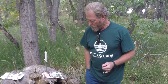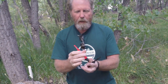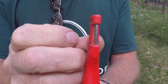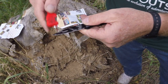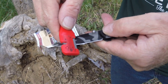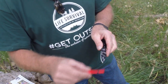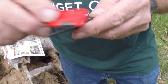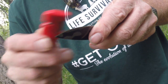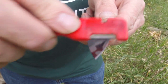Now I'm going to use — there it is. How can something that big be hard to find in your pockets? Alright, so again: two corners, tungsten carbide, 90-degree corner. Touch the 90-degree corner to the blade on the same bevel they ground it at, which is probably about a 12 to 14 degree angle — something like that. Turn it a little bit, come over to where it's comfortable, and start brushing. I don't push too hard; a couple ounces of pressure is good enough. Turn it over and go back towards the handle from the point, then turn it back over and go out towards the point. I actually roll them like this, so I'm sharpening going both directions.